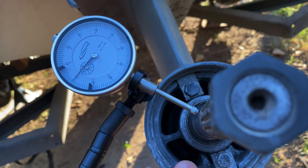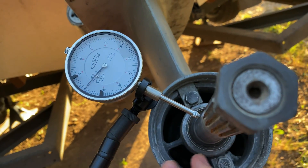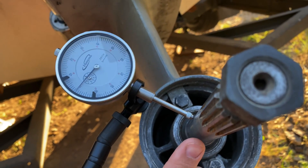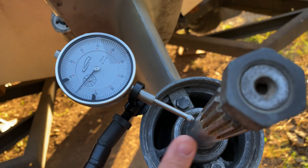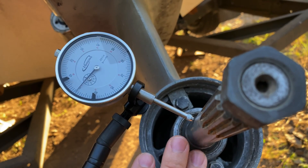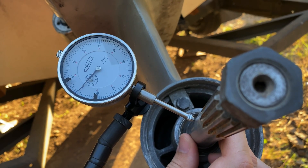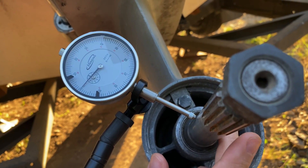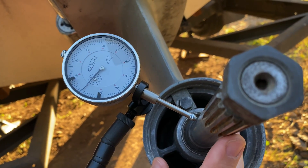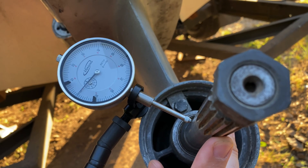This shaft is good. If you're watching this and you have a bent propeller shaft, keep in mind they run about $400. You can take these shafts out — ask me if you need a video on how to remove them, I have a few that show how to pull these out. If you do have a bent propeller shaft, you can often take it to a propeller shop in your area and they'll be able to bend it back for you.